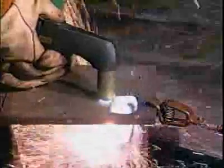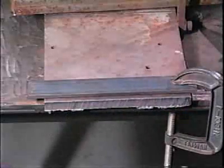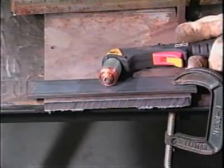Plasma cutting produces molten metal. It's extremely hot. Before starting the cut, make sure that sparks will not fall or be blown toward flammable materials. Plasma cutting leaves a very narrow heat-affected zone, but it still leaves one. The cut material is hot. Use caution. The torch tip may be very hot after cutting, even though some manufacturers include timed post-flow cooling. Allow adequate cool-down time before working on the torch.